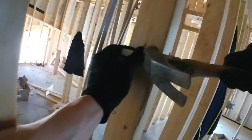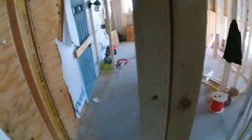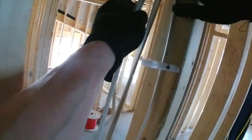Here you see me nailing in some ideal cable stackers. They're pretty good. The reason we have to use them instead of just slamming a staple home is because there are so many wires — you could put two wires under a red staple side by side, but it'd be so close to the edge of the stud that you're asking for trouble. I'm putting three, though realistically you probably only need two.